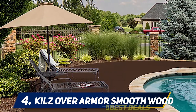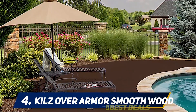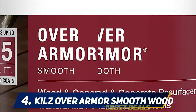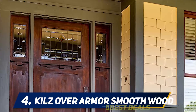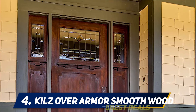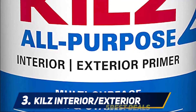This is a one-gallon can of Kilz Over Armor smooth surface coating in redwood, covering approximately 75 square feet per gallon. Not for drivable surfaces such as garage floors or driveways. All surfaces must be clean, sound, dry, and free of any dirt, oil, and grease before application. Two coats are required for optimal durability — brush, roll, or spray on. Wait four to six hours before recoating, and 72 hours for full cure.